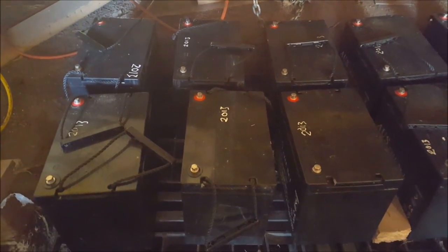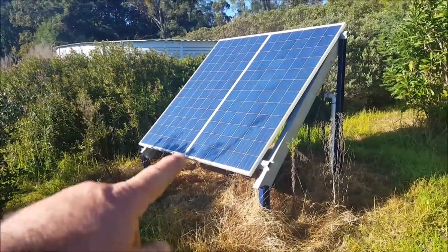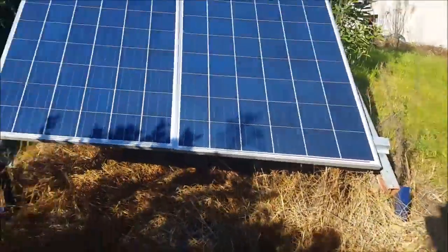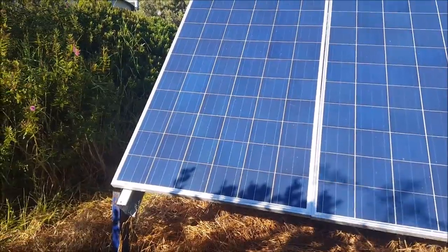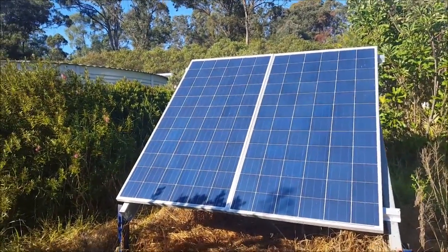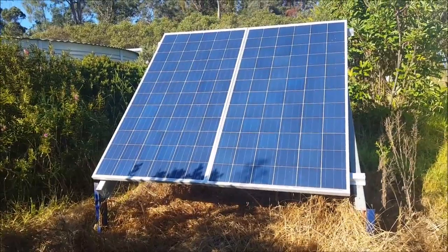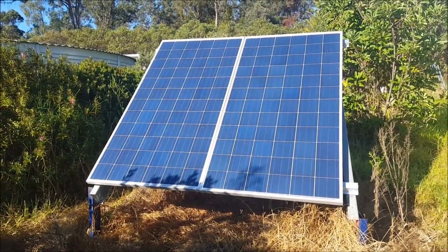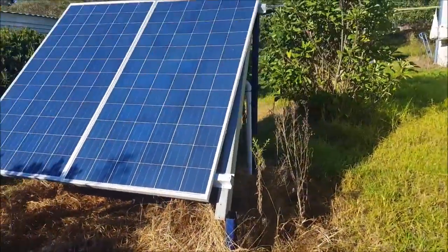There's plenty of power there, so I'll be able to use that for maybe a few other jobs if I'm doing something out in the yard that needs a bit of electricity. Now you can see there, getting a bit of shade there — that's not good. That's coming from this tree here. I'm going to have to trim it up around the top. But with the cooler temperatures, the sun's a bit lower in the sky. That angle's good for these intermediate times of the year — autumn and spring. I'll probably get as much power out of these panels during autumn, some days even more than during summer, because it's cooler weather now and the panels just aren't getting as hot.